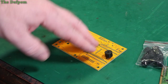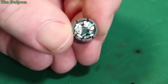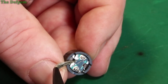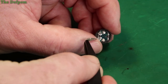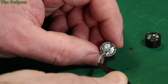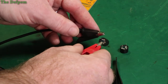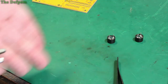I think I've purchased two different lots but this first batch took over a month to arrive. These are supposed to be active ones. Testing with a voltage straight across - I can see there's a wire sticking out on one of them which is a bit odd. After testing, these aren't active buzzers - I think they're just little mini speakers. You have to put a tone into them to make them work, because applying the power supply straight across gives nothing. So these are passive buzzers.